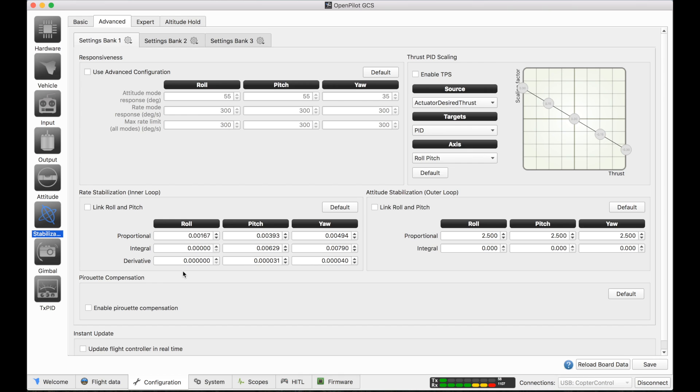With the potentiometer at the bottom, take it outside and slowly increase it until you get a steady oscillation. After you've gotten a steady oscillation you have to land it like that — believe it or not. You can unplug the quad, turn off the transmitter, but don't move the potentiometer — that's the value you need to read. When you come back in and plug in your quad, turn everything back on, arm it, and you'll be able to see your unique oscillation value. Then repeat that process for the pitch channel by changing this to pitch rate KP.